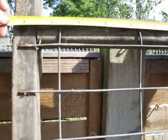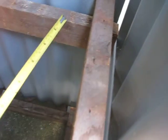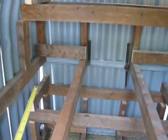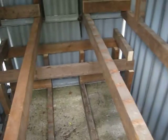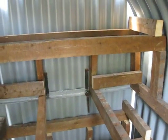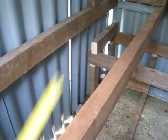The originals were 19 inches wide, and I have gone for 19 inches wide to stay with the originals. These end pieces will be dropped into these long pieces when I've finished — I've just stood them on top for now because I'm going to dovetail them into the wood, so they're going to drop down. Rather than using the thin wood, I'm going to use 2 inch by 4 inch. These come straight out of an old roof of a 1930s house, so the wood itself is aged and probably about the same age as the original shelter wood. I'm going 4 inches by 2 inches rather than 1 and 3 quarter by 2 because these are strong as an ox.